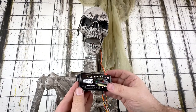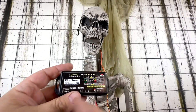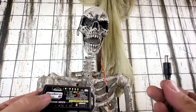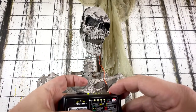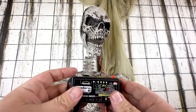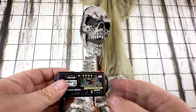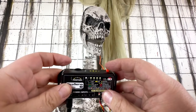When working with servos, you always want to start by setting the parameters. Hold down the button while powering up, and when the top LED flashes green, let go — you're now in the settings menu. The first setting is the input mode, with five choices. We're going to use choice one, which is just the default mode. The other choices are combinations of whether the trigger inputs are interruptible and how they interact with each other. We're just going to use a looped trigger for this demonstration. Press the button to set mode one, then select servo output one.